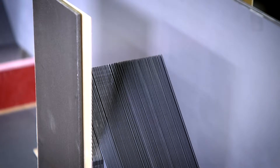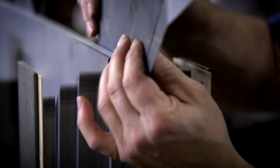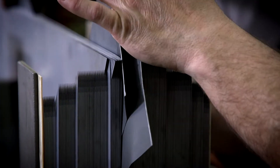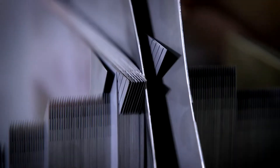Then some other team members assemble the core, which is made up of precision cut pieces of steel coil, to ensure the perfect circular fit inside the coil. This creates a smaller space, which makes the unit more compact for lower total cost and increased efficiency.